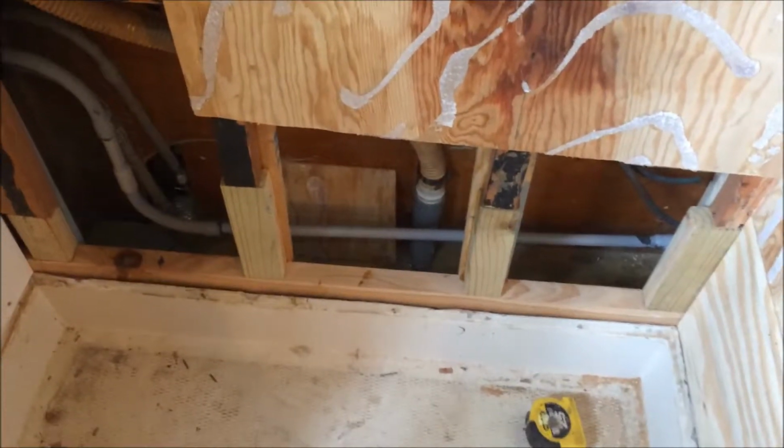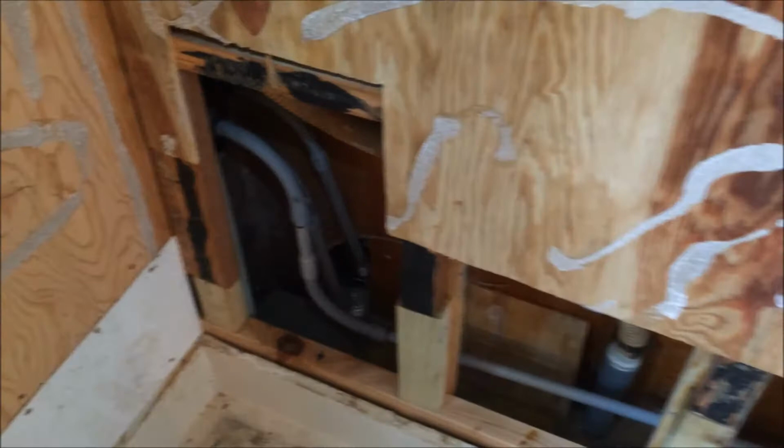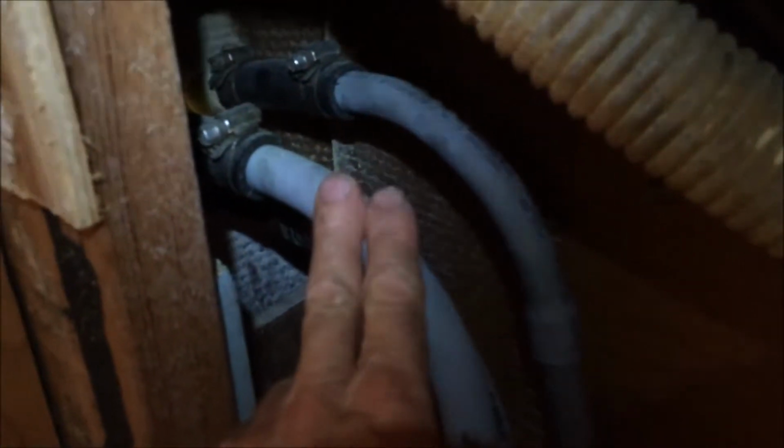My goal for today is to finish behind this shower. Finish the mechanical. It already has the discharge for the front sump pump. That's this one. It has a vent for the holding tank. That's this one. And it has the discharge for the shower sump pump. That's this one. And this is suction to empty the holding tank. And I've got that hard line starting here.